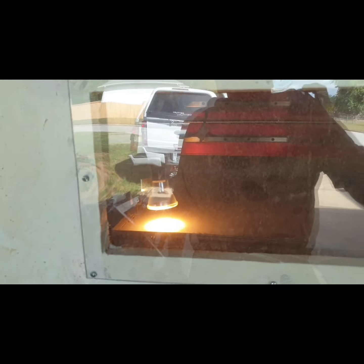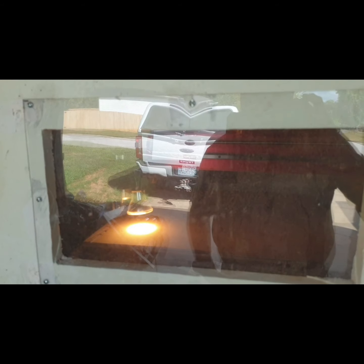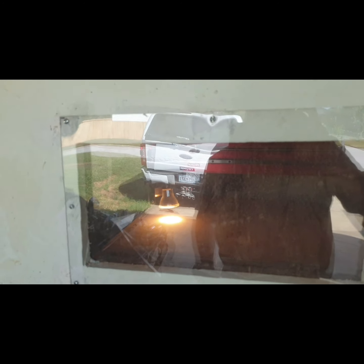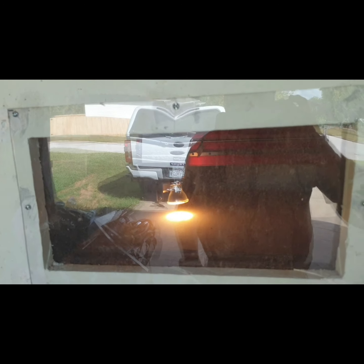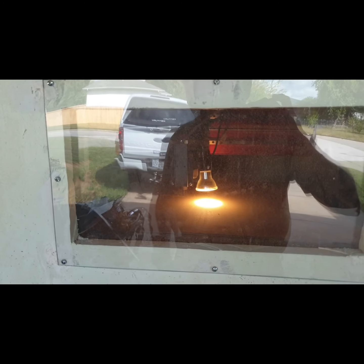What I do is cut these so I make two passes. The first pass is kind of a line-out pass. If I have small parts, it'll line them out and mark where they're going because it hasn't cut through yet, so I can shoot some pins through to hold them. I'm using a 23-gauge pin nailer with half-inch pins, and they easily come out.